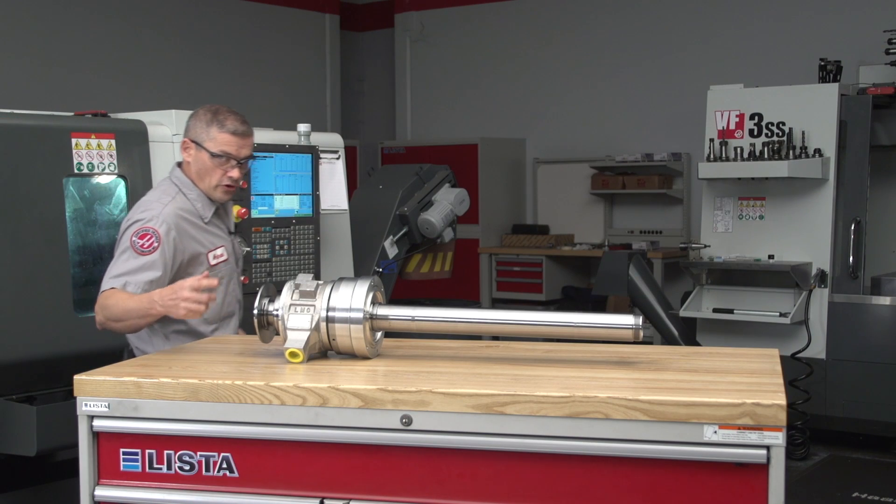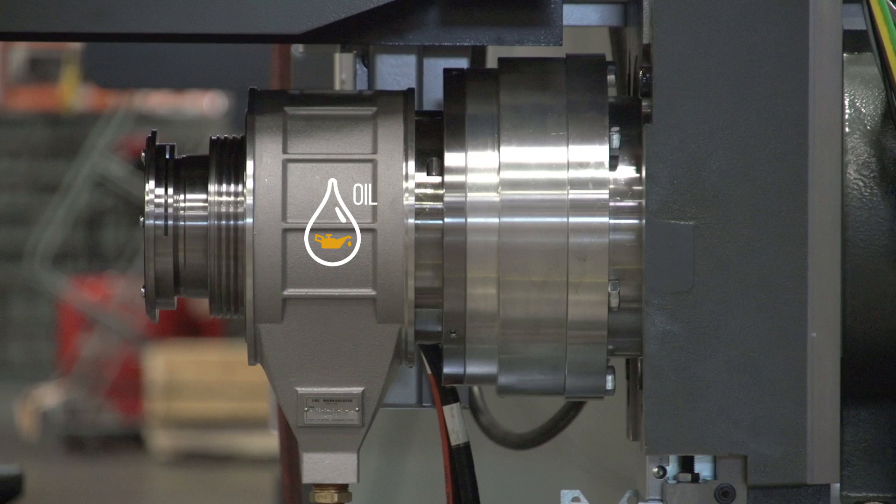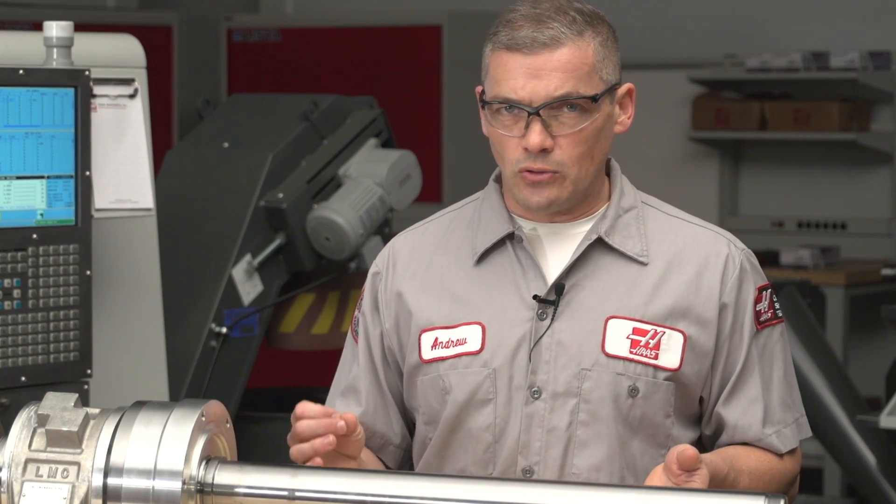As the spindle turns, air is introduced into some of the oil that is flowing through the rotary hydraulic union right here. This air is dissolved into the oil causing it to get foamy. The density of this foamy oil becomes inconsistent and under extreme running conditions the pump begins compressing and pumping this foamy oil, resulting in the varying loads at the pump that cause noise and vibration.